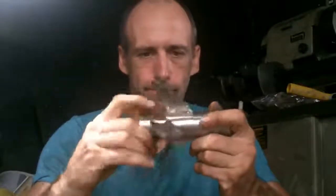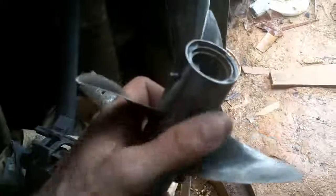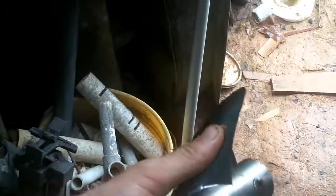This should be a pretty optimized propeller for the boat. Before I made this one, I also did some calculations to check that my propeller blades are at least theoretically about right, and they seem pretty good. I did increase the pitch just a little bit based on the calculations, because according to my calculations my old propeller was limiting my speed at about nine miles per hour - and I got up to about 8.9 miles per hour - so I made this one to hopefully go more like ten. I did have to buff the inside because that pipe was an exhaust pipe, so the outer curve was very shiny but the inside was pretty rough.